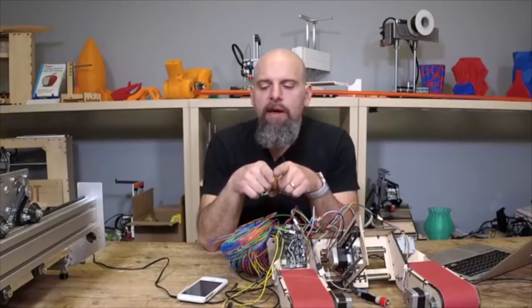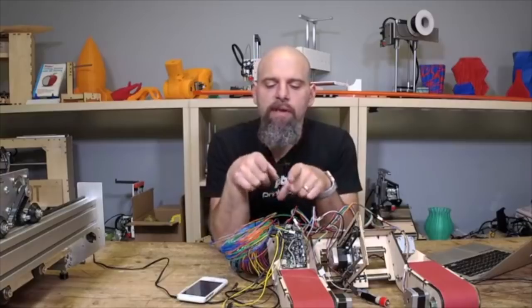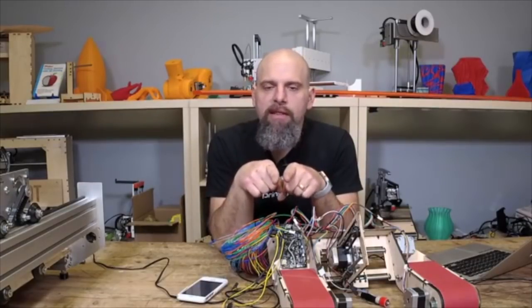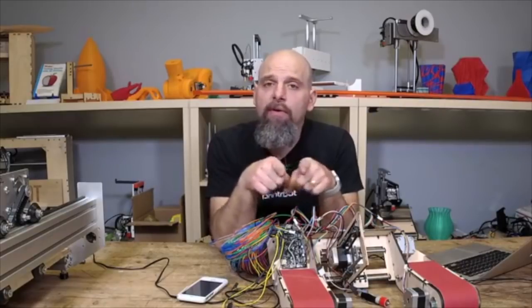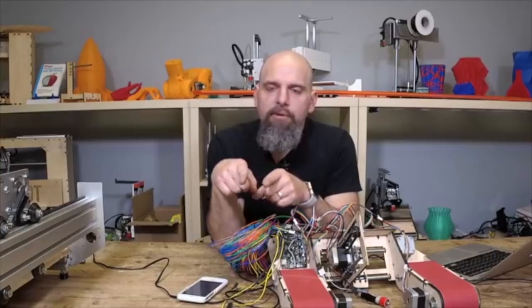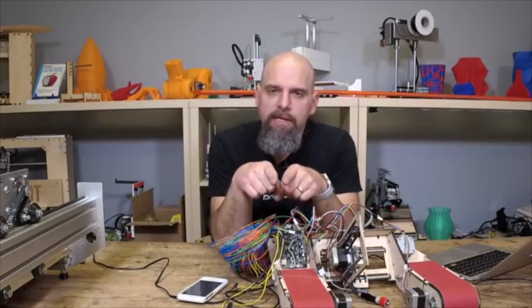And if you don't have another axis to move it up out of the way, or a spring or some kind of electronics to move it, a lot of dual printing machines are just side by side, and the nozzle doesn't raise, so you can drag across. Now you can do Z-hop to help that, but while it's printing, it's going to be right there at the same level as the other nozzle.